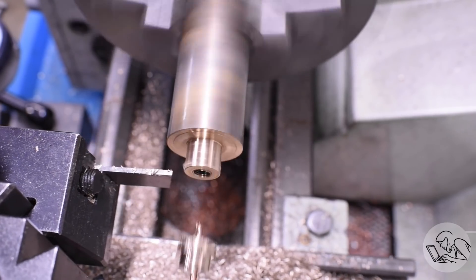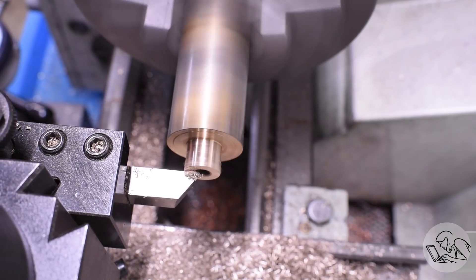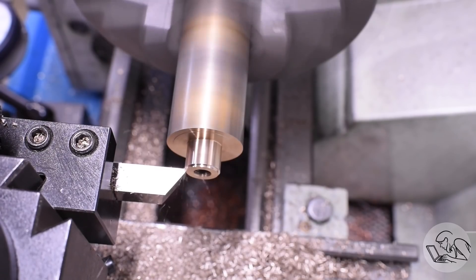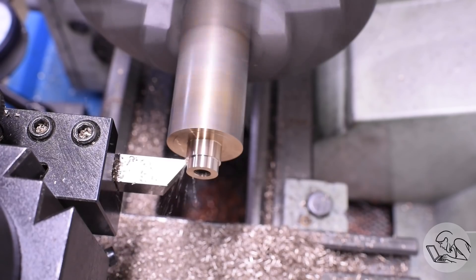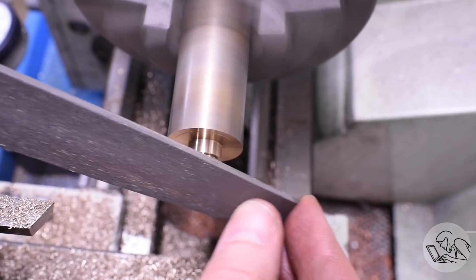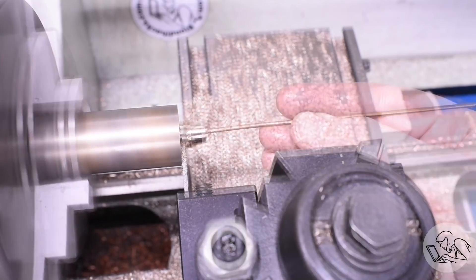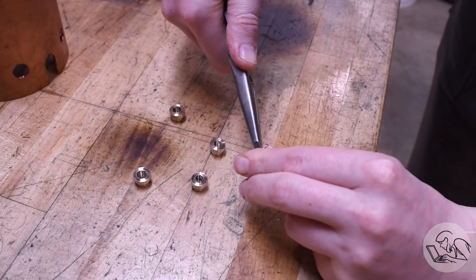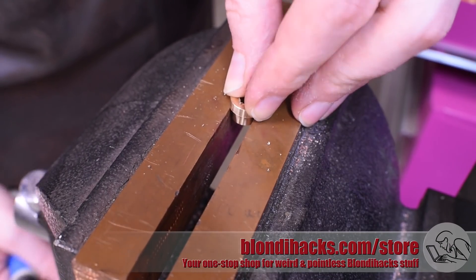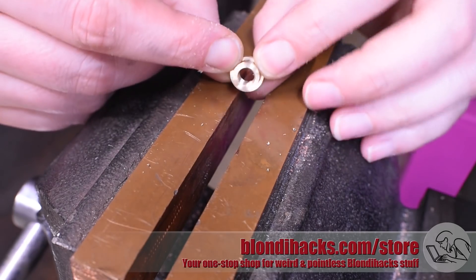Then the next three go much faster with a couple of simple tricks. I faced off the mess and without moving the tool I set the indicator, knowing exactly where that face is since the tool just created it. I noted the hand wheel setting from the previous one - since each pair is the same dimension, I can turn down in multiple passes to the same hand wheel setting and know I'll be at the same dimension. Then deburr that and part it off. Most of the deburring is done with pliers - you can just use them like a can opener - and then finish up with the Noga tools. I prefer thin parting blades so beveling the front of the blade doesn't really work for me as it just causes deflection.